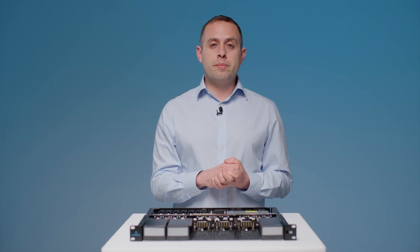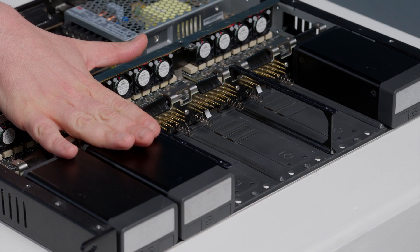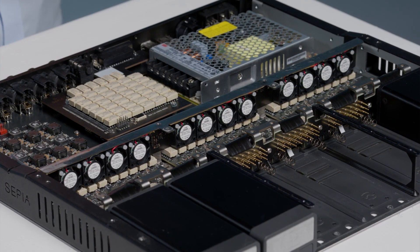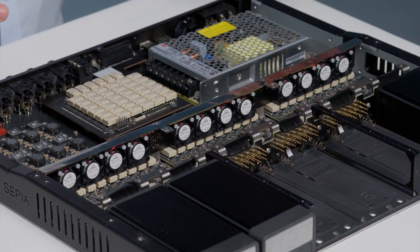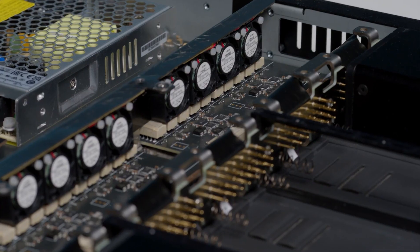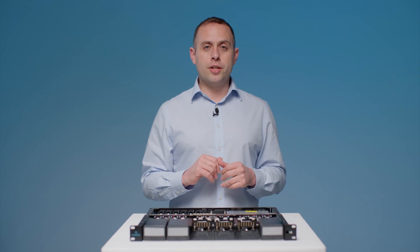From power to thermals — we took the thermal design extremely seriously when designing Sepia, especially as it allowed us to lower the footprint of the modules themselves. It all starts with two thermal bias springs on the module alignment that lift the module to the lid once inserted. Heat is transferred onto a high-conductive aluminium alloy and then travels back into a channel populated by heat sinks, an air gap, and temperature-sensing fans that maintain almost silent operation. For more information you can find it at carno.com.